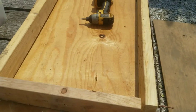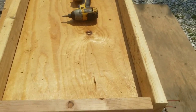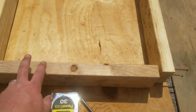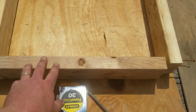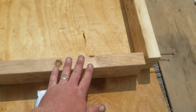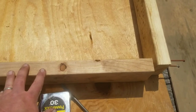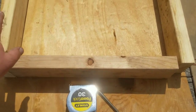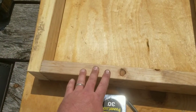Okay, you guys that know what you're doing a little better probably already discovered I was going for 45 by 20 inches across. I took out an inch and a half for this stud. I needed to take out 3 inches for this stud. So you don't cut these 18 and a half, you cut these to 17. I'm going to fix that now because that's going to ruin my plans. I want it 45 by 20. So these will be 45. These need to be cut to 17.